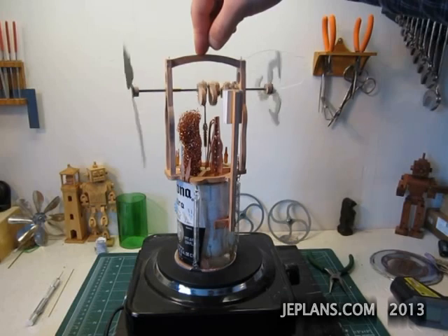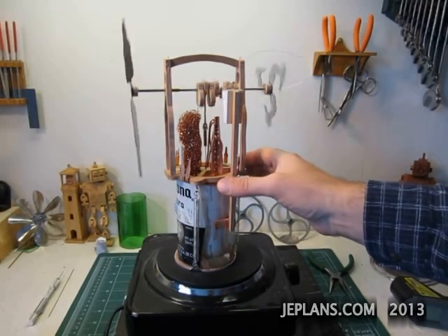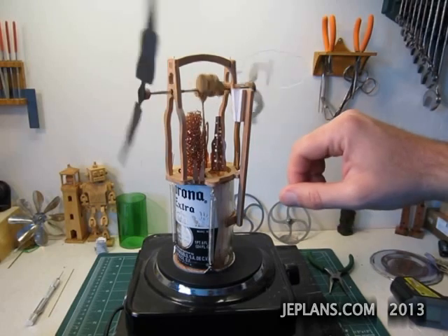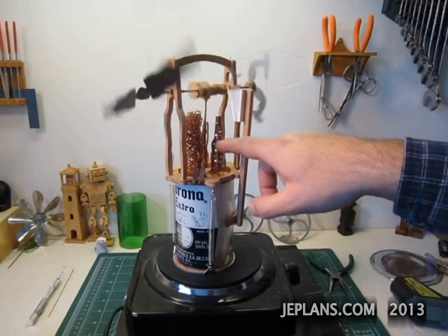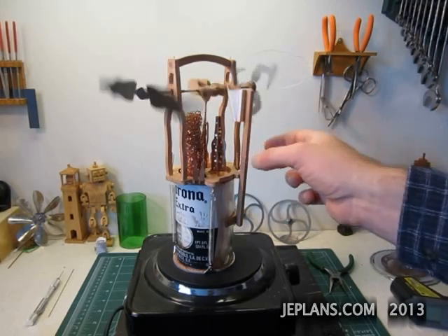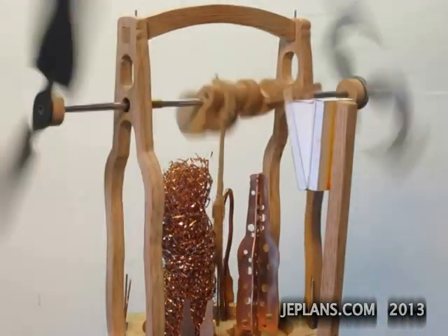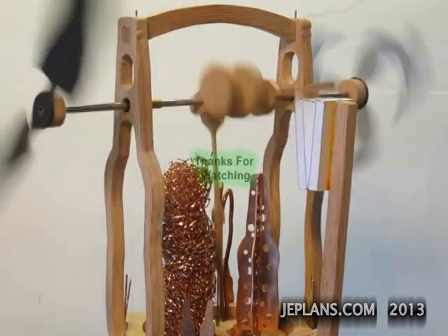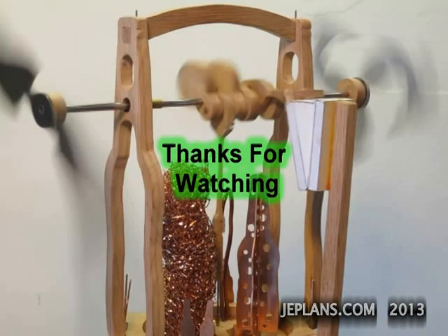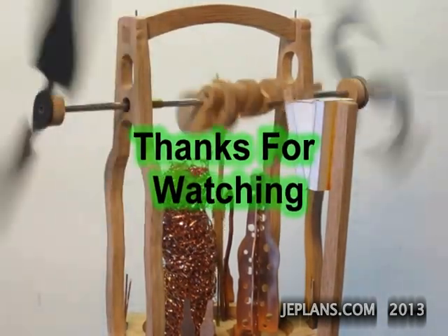Once I'm completely satisfied with the design, I'm going to glue everything together tightly. For now, this lets me disassemble and reassemble. I'll probably go ahead and replace the other heat sink options with the beer bottle shaped one because that just looks cool. The engine's running okay, but I think there are several enhancements I can make to get the starting temperature under 200 degrees. In the next segment, I'll have a new piston design, a new displacer design, and a few other modifications. Thanks for watching.